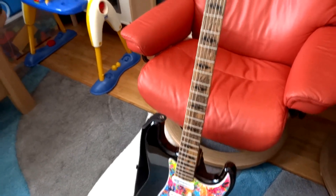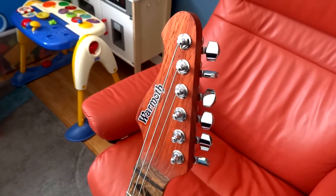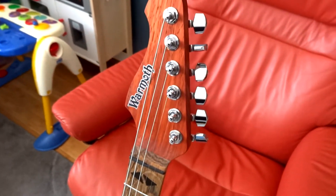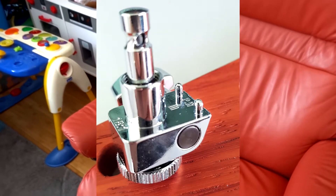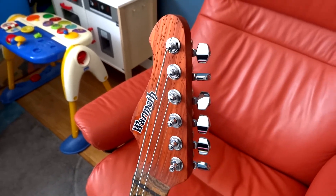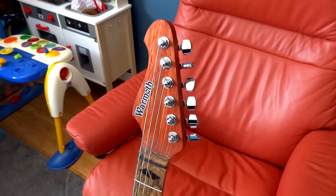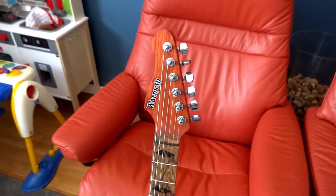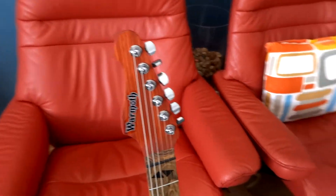Part two of the video — I managed to install the neck on the guitar. It was pretty tricky, especially because of the locking tuners from Fender. The issue was I had the basic 10mm holes in the neck, but the tuners had two pins to keep the locking tuners in place and avoid them turning on the axis. Those two pin holes were not drilled in the neck, so I had to measure them, position them, and it was a very big mess to create the template to position the 12 holes correctly. But I did it, finally, after struggling a lot.